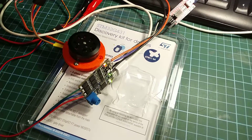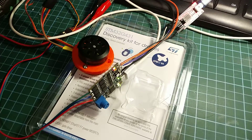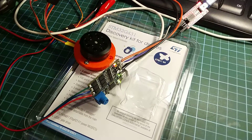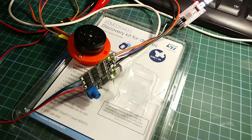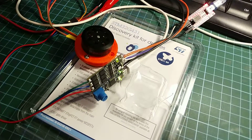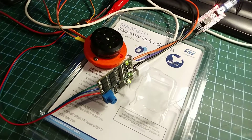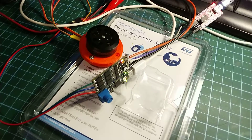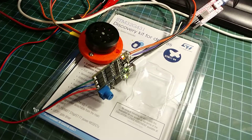This is my first attempt at doing six PWM control of a BLDC motor. I'm not using SimpleFOC at the moment, just wanted to try and get the high and low side working. I'm basically taking six-step commutations, doing 60 electrical degrees each time.